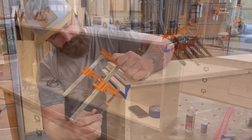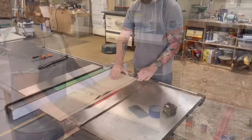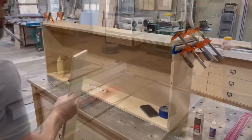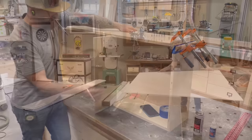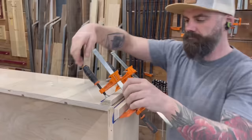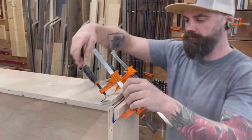While waiting for those corners to dry, I started getting measurements and cutting my internal dividers — ripping down some half-inch ply and testing if it would fit into the pre-cut dados. They were snug but I was confident I could pound them in. I cut down a whole bunch more to that same width and set them aside. Once the corners were dry I removed the clamps and the cauls popped right off — no problem. A little residue rubbed off with a finger, nothing a little sanding won't take care of.